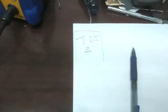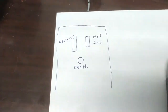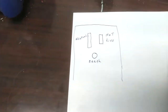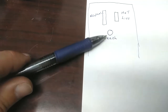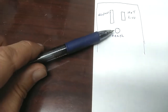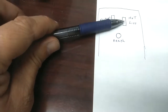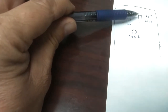When you look at a wall plug, the typical modern plug has a neutral, a hot, and an earth ground. The neutral and the earth ground, back at the breaker box, are actually connected together. So you can touch those two all day long and not get shocked. It's only the hot where the power comes in — that's where the issue is, and we have to keep that one isolated.